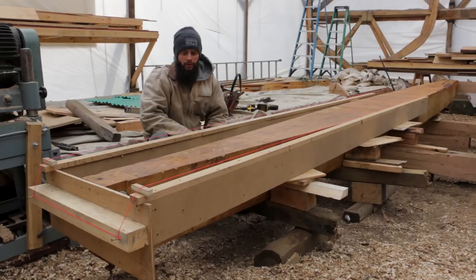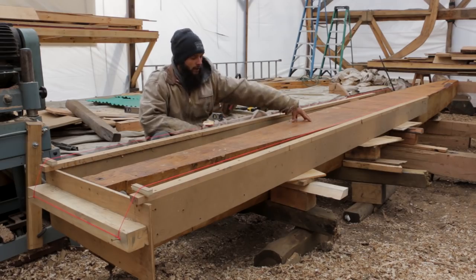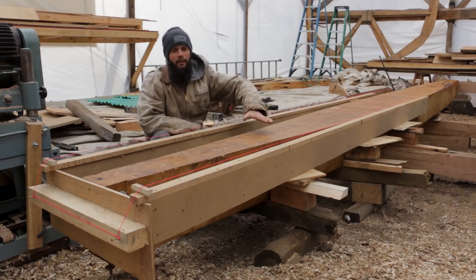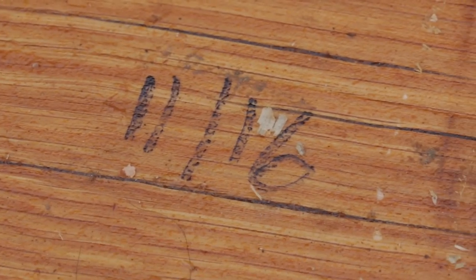One of the next tasks we have to do is flatten and thickness the keel timber. Right now it's oversized — it's too wide and too thick, which is a good thing because it's not cut perfectly straight and the surface isn't perfectly flat. We need it to be to match up to the ballast keel. We have a setup here to flatten it using a router and a sled. The first step was putting a line down the middle of the keel and measuring from the keel to that line to figure out where all the low spots were, writing them on the keel with a marker.